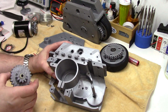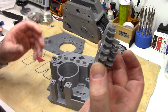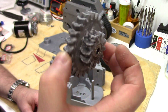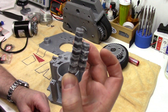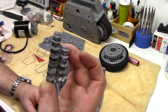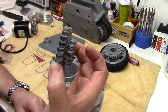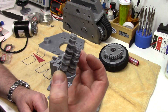One of the hardest things about building these feet is fitting the gears. They use interesting shaped gear teeth — they're not straight gears and they're not helical. They're kind of a chevron shape. What that does is make the gears center on each other — because they're chevron shaped, they'll center against the other gear. But it makes fitting everything kind of a bear because stuff doesn't just slide in; it's got to mesh and wiggle as you put it in. I'm not too sure why Michael uses chevrons — perhaps they are stronger than a straight tooth gear. If anyone knows, leave a comment below.